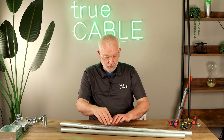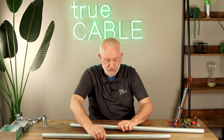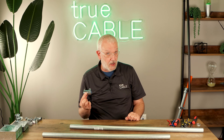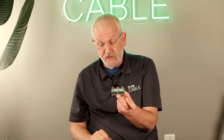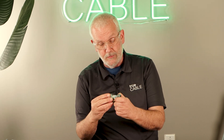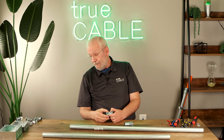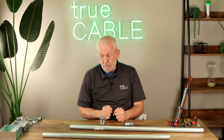Right now what we're going to do is join two pieces of conduit together in a union. We use an accessory called a union or a coupler. There are two types in main use: a set screw type, which uses set screws to make a positive connection to the conduit, and the compression type, which uses a steel band inside that compresses around the outside of the conduit.